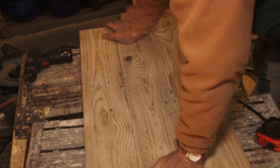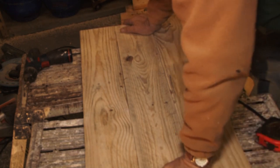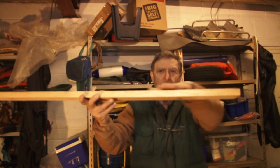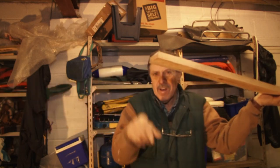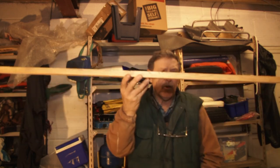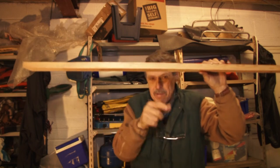Now I'm going to work on the legs and what we call in the trade the stretchers. Okay, if you can imagine, it's a bit long really, that's a flat of our drinks table. I'm going to have legs in each corner, as it were. They could get a bit wobbly if it gets moved around. So in the furniture trade, they fit what we call stretchers, which are two cross spars, or it could be single spars that go all the way around the edge.